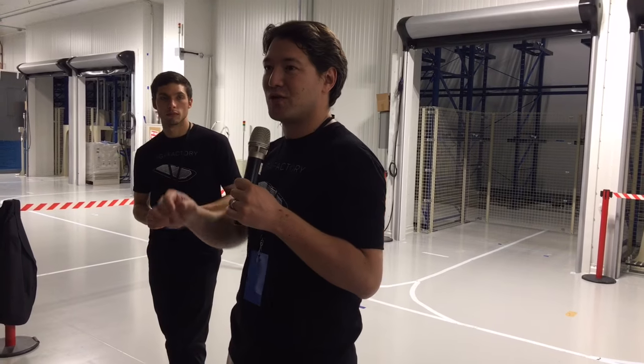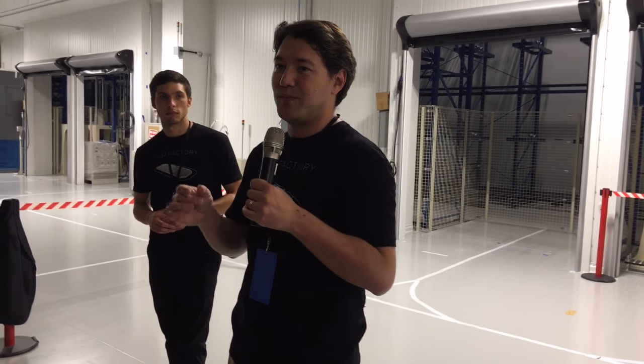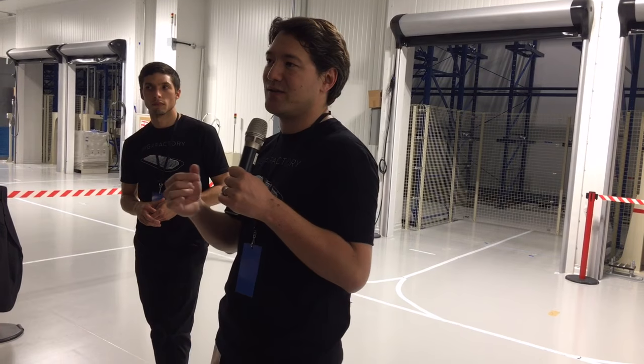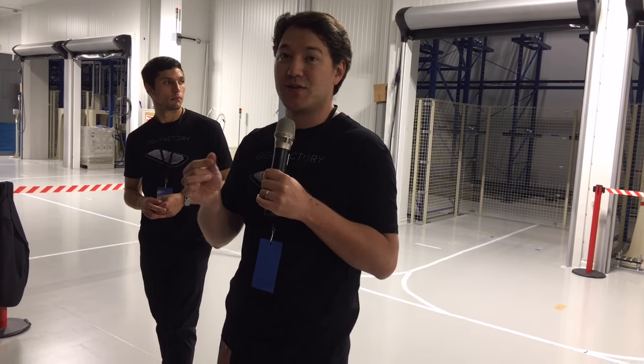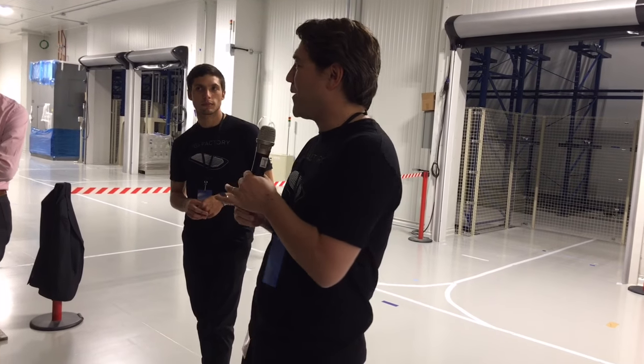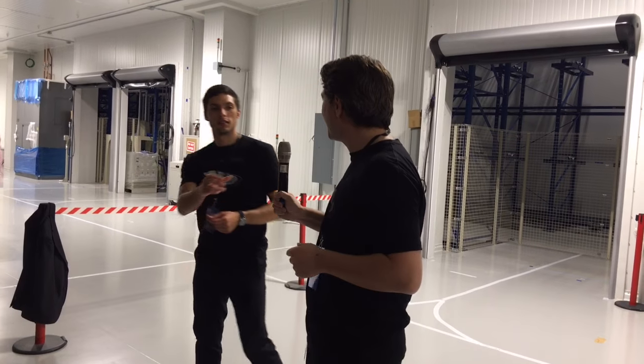So what we do is try to control that porosity to be able to control the flow of lithium ion into and out of that material. We're trying to compress as much as we can to pack as much active material as we can without disrupting the molecular integrity of the material itself, to the point where the lithium ions couldn't really flow into and out of the electrode. So Brian will tell you a little more about how that actually happens over here.